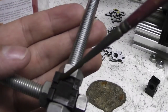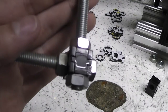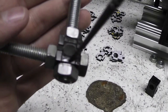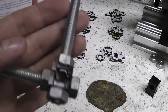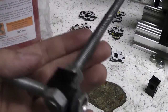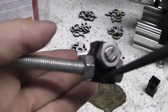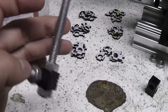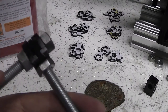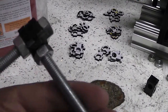I'm just running large amounts into the tracks here. It's nice to keep the larger faces of acrylic on this machine nice and shiny, but this piece is not about getting something that looks pretty — it's just got to do a job. Because these M8 rods are going to brace the entire x-axis, they're going to hold the z-axis vertical, and because I can twiddle these nuts it's actually going to let me square the whole thing off quite precisely.